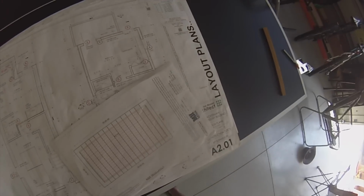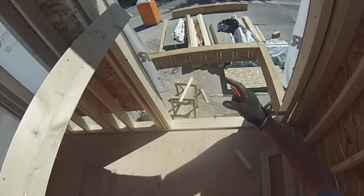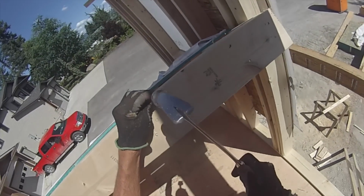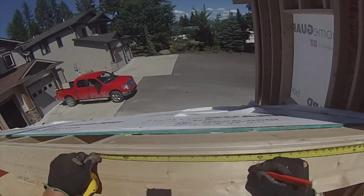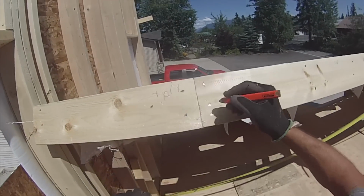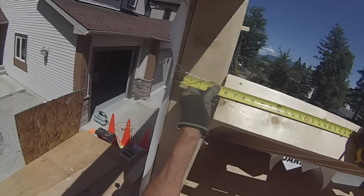You know, this would be very easy to lay out now, so I'm going to do that. It's 30 feet, 2-foot centers. Okay, we'll start over here. Keep in mind, we're 5.5 past, so put 5.5 there, mark 23.25. And punch a nail in that. Every 2 feet from there. 2, 4, and so on. Last one. Oops, 26. There. So it should be 23.25 to this side. So I hang over 5.5. 23.25. Okay, seems to be working. A few more pumps.